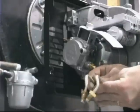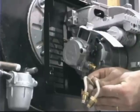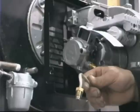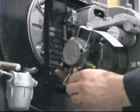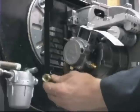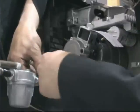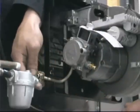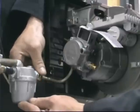Two oil lines are supplied with the burner pump set. The supply line is the straighter one, and the return line is slightly more bent to accommodate the burner cover. In a two-line system, both the supply and return lines are used. Install the supply line first into the supply port nearest the backplate. Tighten the line hand tight and position it in the lower slot in the backplate. Secure in place using a 15-millimeter wrench. Attach the line to the metric-to-NPT adapter and tighten the coupling using both 17 and 19-millimeter wrenches.